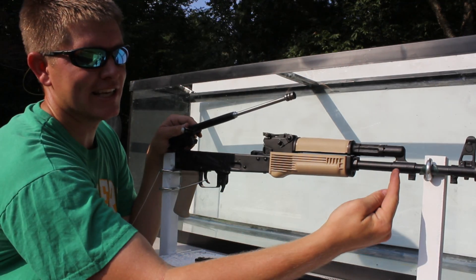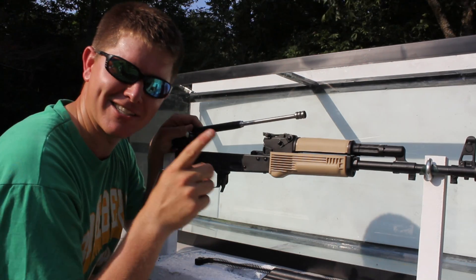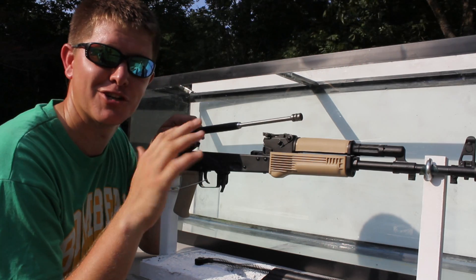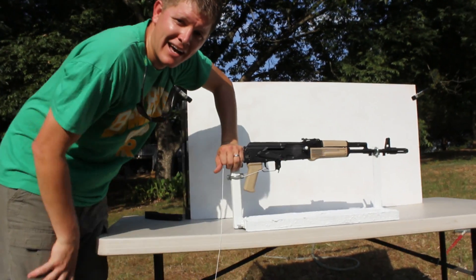So here's the question: as the gas flows into the cylinder and begins pushing down this piston, what happens to all this water? My hypothesis is that it's going to slow the bolt down, but we're going to use the high-speed footage to determine if this is correct. We have a little bolt cover here, and we've painted the end of it white so that we can measure the velocity of it in the high-speed video.